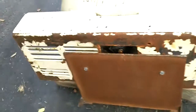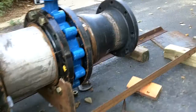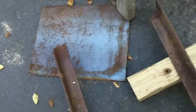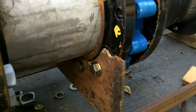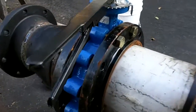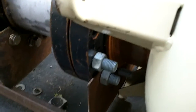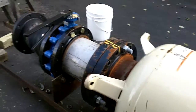That's permanently welded now and bolted. What I don't think you've seen yet is these braces here that we've made. They're real simple — basically we take a square piece of metal, draw the line to match close with these flanges right here, and then cut them with the cutting torch. That part's fairly easy. Then the harder part is drilling the holes, because those holes are pretty big. To drill a hole like that through eighth inch steel, it takes some time. If you do it right, you can get all four holes done in 20 minutes, but that's still a lot of drilling.